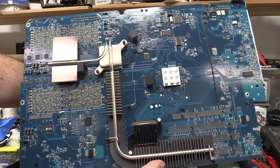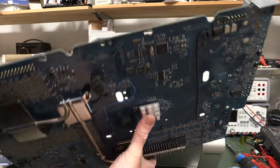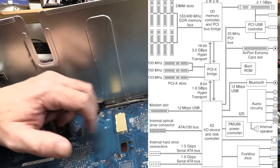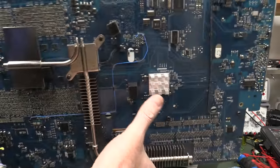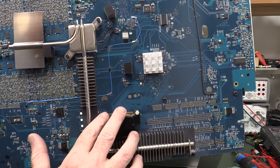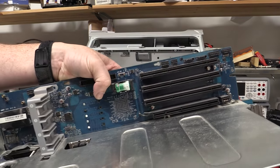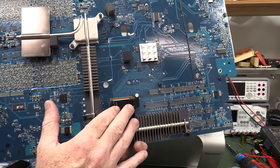Oh, look at the heat piping on the bottom of that baby. Didn't see that one in the previous teardown. Nice little chunky finned heatsink on the bottom of the BGA there, which is under the processor. That's like the interface, I don't know, the Mac architecture, the G5 processor system architecture and stuff. But obviously they need that big-ass BGA there to interface with the processor. Is that like a memory controller or I/O interface? Something like that. You can see the differential pair traces all come down here to this baby, which is another one. Oh, there, given its location, that would be a bridge slash interface driver for the slots there, I would be guessing.